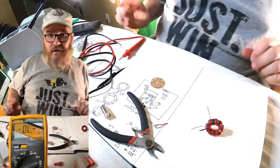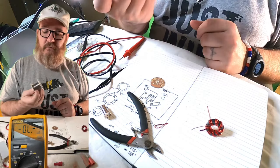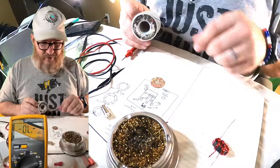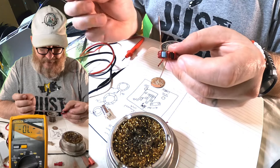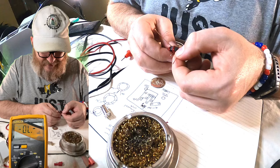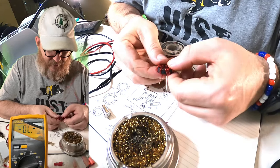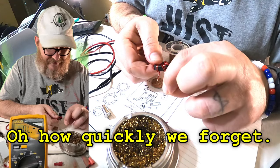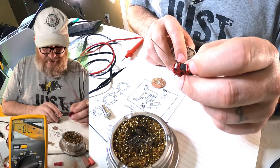This is how this is going to happen — I have to plug in my soldering iron. The soldering iron is now heating up. We have some Radio Shack 60/40 solder — it's probably an antique; I've had this particular roll since about 2007. We're going to get the tip cleaner and we're about to make some connections. I forgot what was what: this is ground, the inside is your output, and this is your input. I remembered because ground was the first wind so it went to the inside, and output was the last wind so it went to the outside. You can't miss your input — it's twisted.